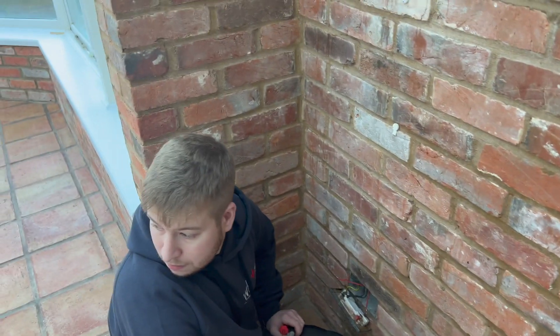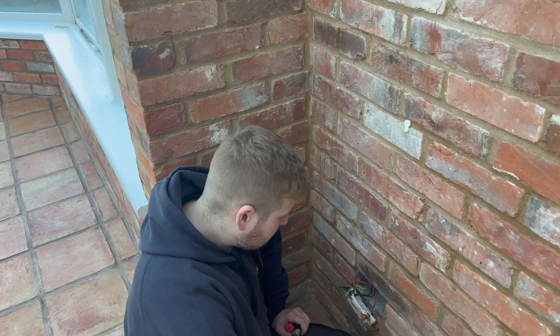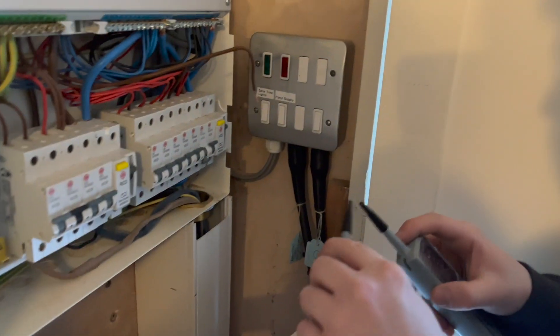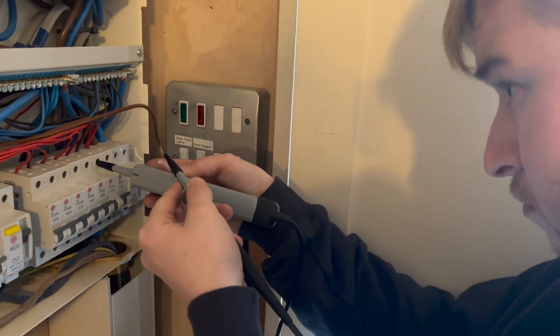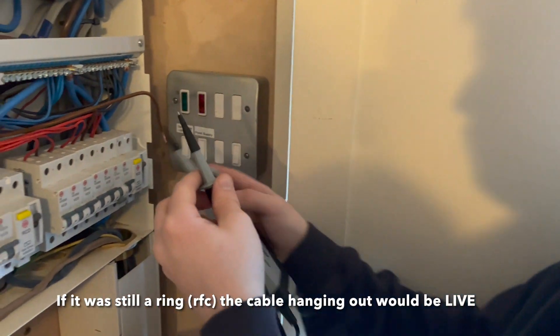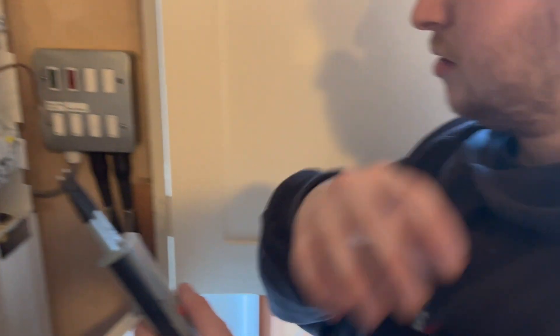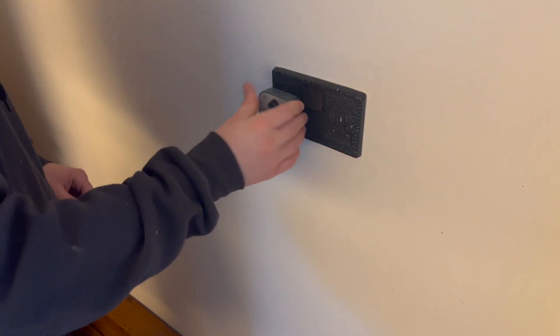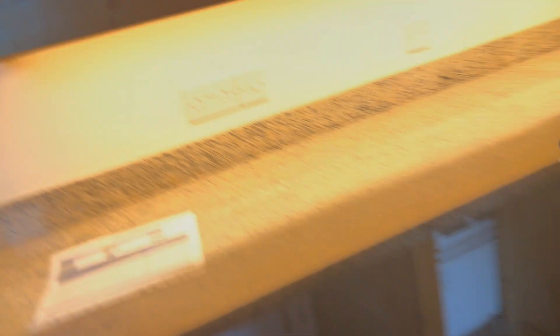We presume that's the closest to the kitchen utility, so we're putting each leg away. We've checked to make sure it's a ring at the board — we crudely just did it with a continuity tester. Now we're literally going to dub them in and see which holds on and narrow it down. We're making sure there's no continuity since we've split the ring, making sure there's not a ring within a ring. Now we turn it on and see what's live.